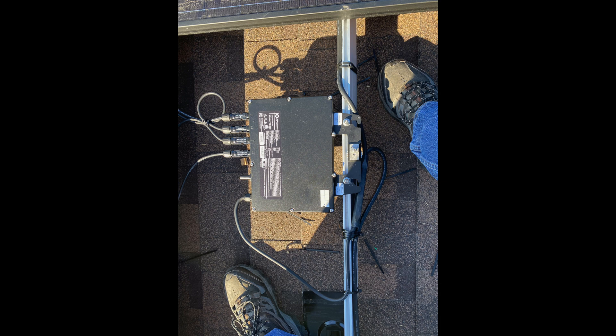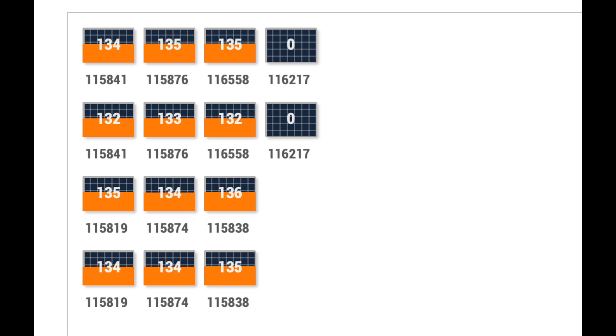I've had one of the microinverters on the system fail. This is the AP Systems YC600. Each one of these microinverters handles two solar panels at about 400 watts apiece. I noticed the output on one of my subarrays — my subarrays are all 14 panels, there are four 14-panel subarrays — was reduced. I went on to the AP Systems website and it was showing those two panels were dead, meaning one microinverter had probably failed.